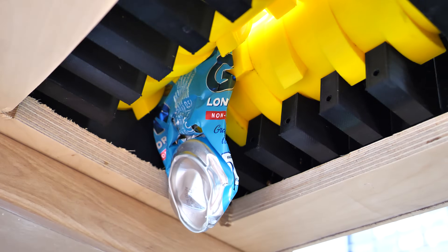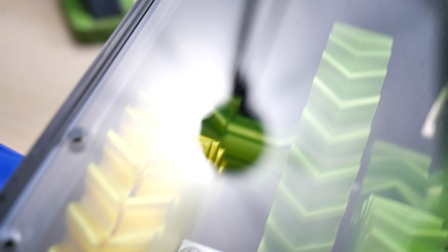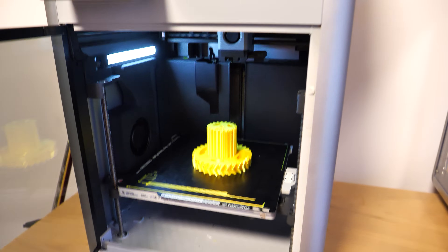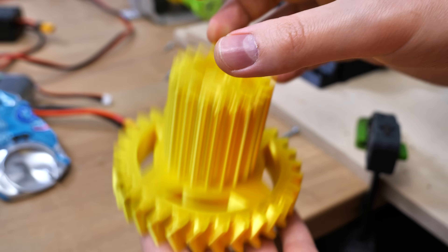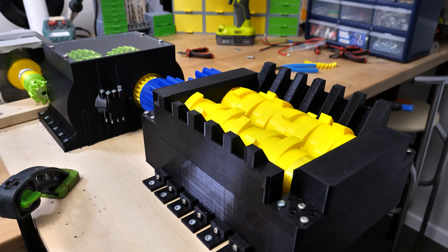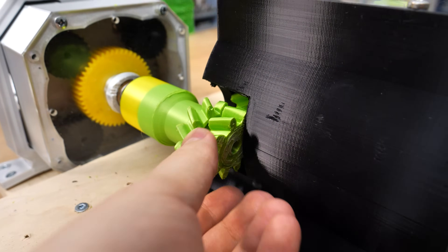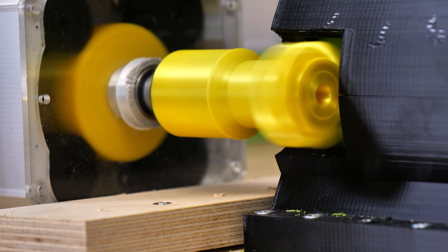The can almost got through, but the top of the can — which is much stronger than the rest — didn't make it. Even more interesting is where it failed: the big output gear literally snapped in half. Almost. In my channel history I've never seen this type of failure before. I printed a new gear with 100% infill, and thankfully the Bambulab X1 is fast enough — it only took 6 hours. After disassembling and reassembling, I'm good to go. As Einstein described, doing the same thing over and over expecting different results is insanity — but I figured I'm not insane, the broken part is fixed, and I'm going to try something else before doing the can test again.